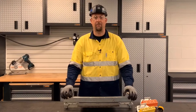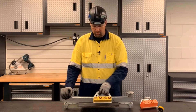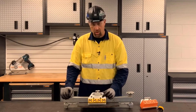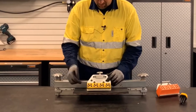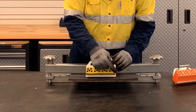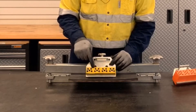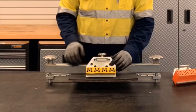Here, the MSRT is set up for a standard SR installation. When installing with a powered rivet driver, note the installation sequence. We'll want to install the outer row first, nearest the scalloped edge, then the middle row, and then the inner row closest to the belt edge.